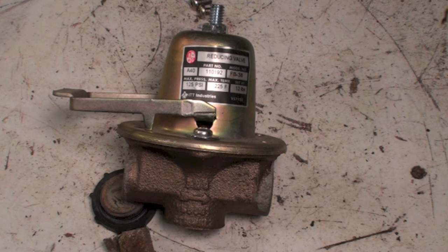Usually they get to their pressure, they stay there 5, 10, 15, maybe 20 years. And then all of a sudden they lose some water because they had a leak someplace or something, and then it won't feed because it's just jammed. So I end up replacing an awful lot of these valves. There were just too many problems with them if they've been in over about 5 years. And that's the FB38 pressure reducing valve.